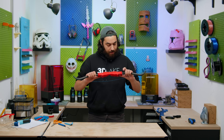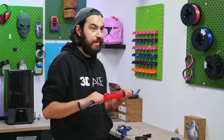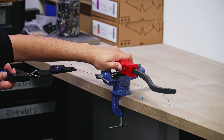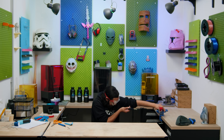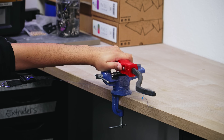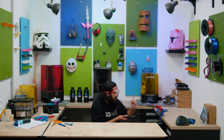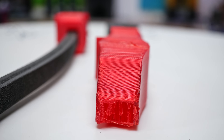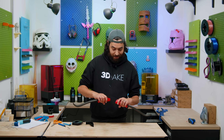Here's the next experimental piece: PETG carbon fiber limbs and a PCTG riser. Let's see how it goes. Two kilos, three kilos, four, five, six, seven, eight, nine, ten — the riser broke again. So PCTG just isn't enough for the riser to stay in one piece. I need to strengthen that and get back to it.